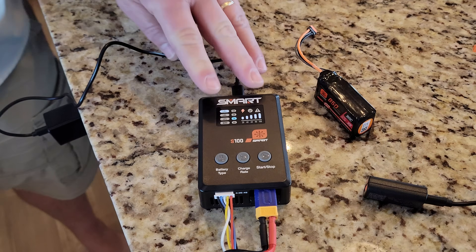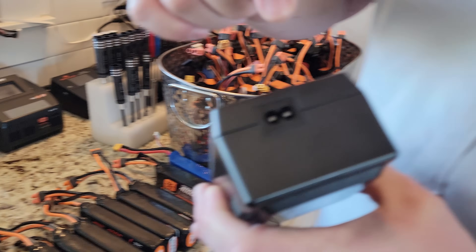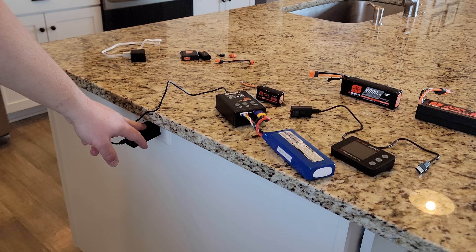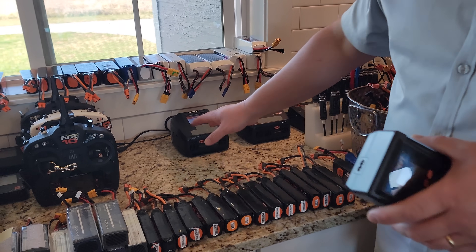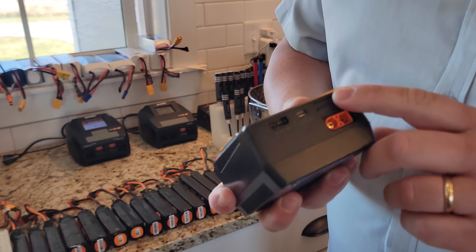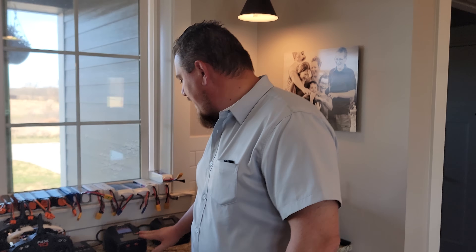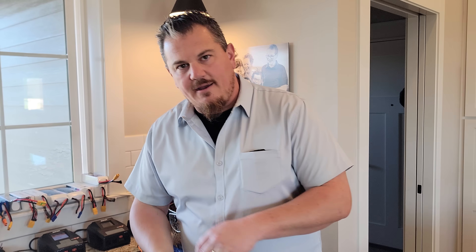If you're looking for an upgrade from the S100, the next step up would probably be the S155, which also has an AC input so you don't have to provide your own AC to DC adapting. It also has a small screen. It's still IC3 to IC5 sizes, but only two through four S. The reason I really like going up to the S2200 or S1200 is you add up to six S compatibility. Charging beyond six S gets way more complicated and a lot more expensive — we've done that too, up to eight S on our channel.